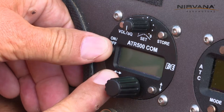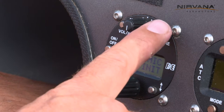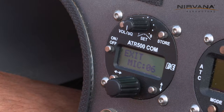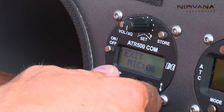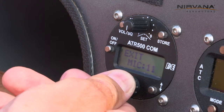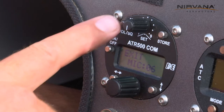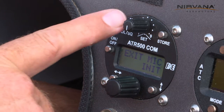The Init menu is accessed by holding the cursor button and pressing the on/off button. Press the store button and put the desired settings for the item microphone, and confirm the settings by double pressing the volume button.